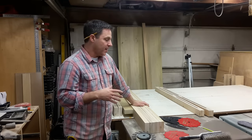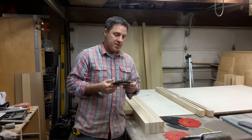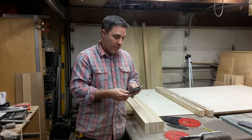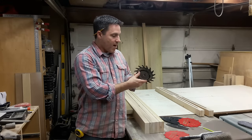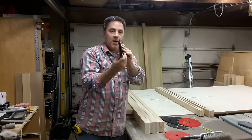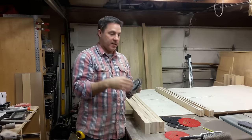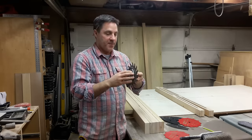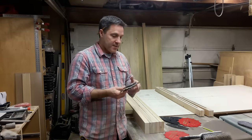I've not used this tool before here on this channel, so let me walk through it. There are a couple of different types of dado blades. There's an adjustable dado, which is less expensive typically - you just dial it in, and as you turn the dial the way the arbor spins determines how thick the dado channel it plows out is. What ends up happening is it wobbles like this when it's on the saw. It's essentially a saw blade sandwiched between special mechanisms that as you twist them allow the arbor to get wider or narrower for your cuts. I used this for a long time before I got the other set.